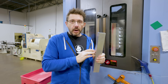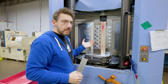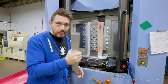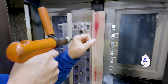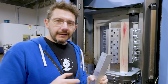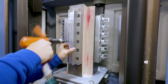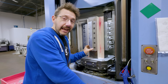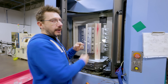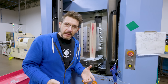The next step in the process is to take this raw material, the aluminum, and put it in this horizontal mill. This is a tombstone and it's four-sided and this is where they're milling all of the NG extruder bodies. What I have to do is remove these first and then I can put this in. With those pieces off, I can now load the raw aluminum that we cut over there. Just like that, it's loaded. This is going to take the tombstone, once the rest are loaded as well, and flip it around to the mill side where it's going to throw a bunch of coolant on it as it's cutting out the shape. So all I have to do now is close the door.